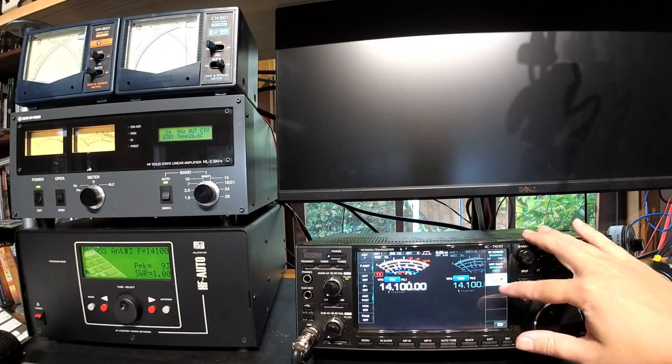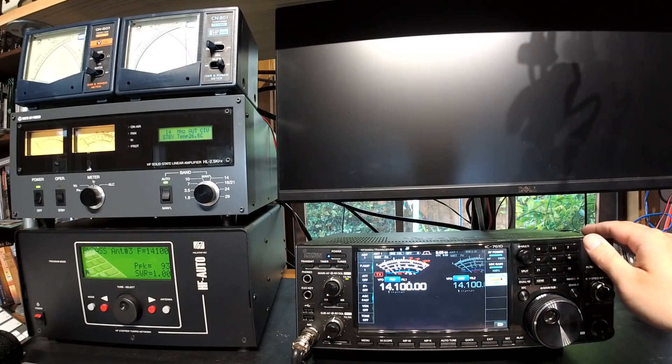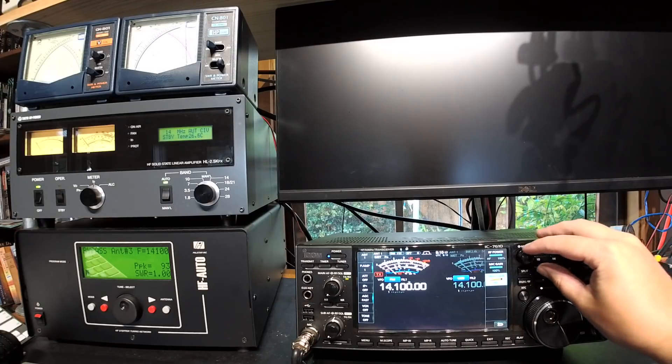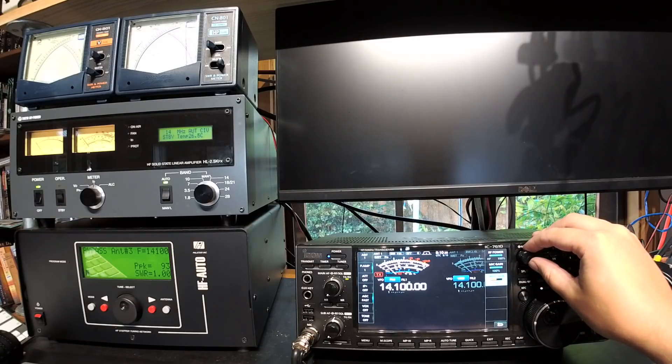The radio had not been used to transmit prior to this fault developing today. I'd recorded some audio coming out of the speaker jack — that was about it. I've done the exact same thing with the exact same recorder on my 7300 with no issues. I can't imagine having an external speaker, a microphone plug, and a microphone held in front of it causes issues. I'm not really willing to push it further to demonstrate the fault, since I don't want to completely kill what I'd assume to be some component that's part of the drive transistors or even the main PA board.